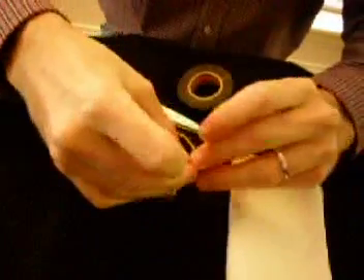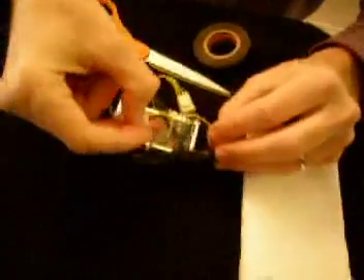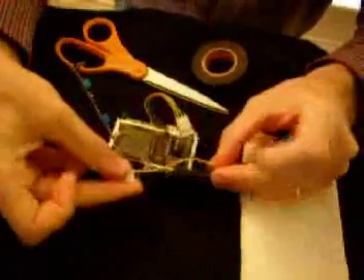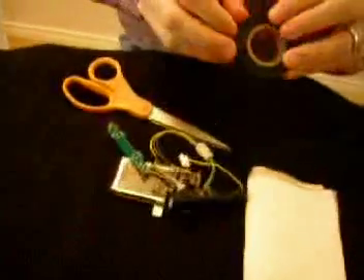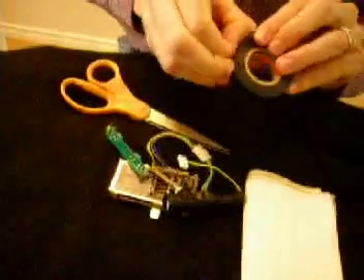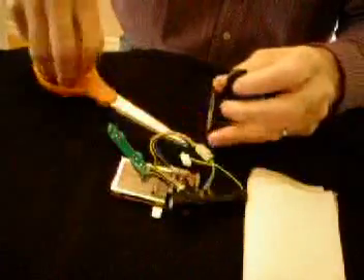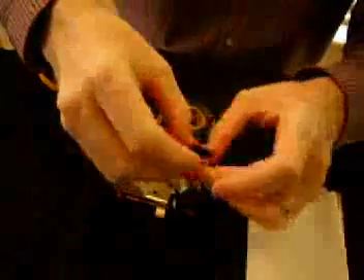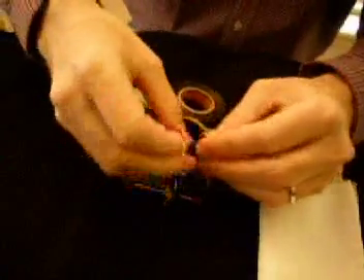Alright, so here you've pretty much covered up that part, but you see these pins are exposed here and these are exposed here, and this is floating around inside your mixer — that might short to something. So just to be safe, I would highly recommend it. It's very simple — all you do is just take another piece of tape, actually two pieces of tape. One is for here — just make sure this is all wrapped up so it's not going to short to anything.